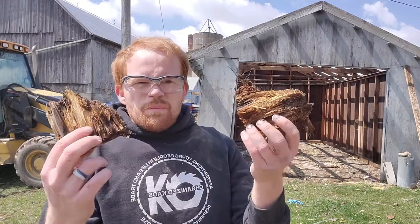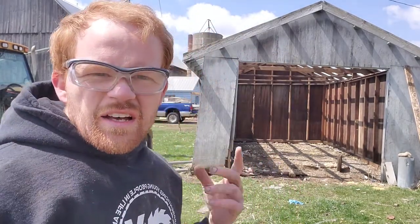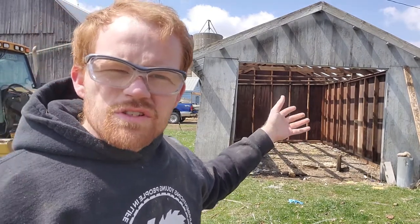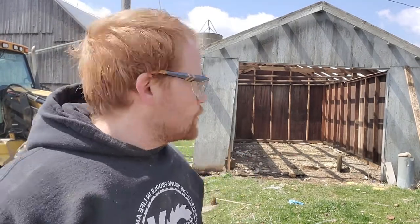So I found some remains of what used to be a post. Buried in this shed there are some cement stones — patio stone type things — about two and a quarter inches thick. So I'm gonna dig down this corner enough that I can put one of those stones in the right spot, and that's going to be our new foundation.